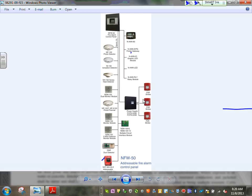We have our speaker coming in a few minutes. I want to remind you that you are to drop all your fixtures and circuit them and switch them and tag them. By the end of the day, please print from Revit 22 by 34 before you leave. That's the expectation for the day. When the speaker comes, I don't know how many of you are familiar with low voltage. I talked a little bit about low voltage control systems, 24 volt. He has a panel. It's really cool to look at what they're doing. So thank you.